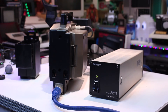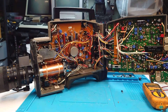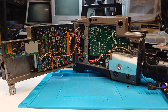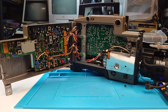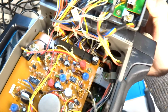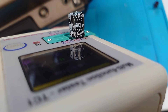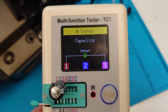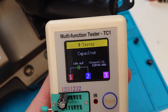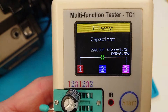Unfortunately I don't have a service manual for this camera — the only one I found is on eBay in America and it's about $20 just for the postage. I've opened the camera up and had a look inside, and I cannot see any internal fuses, which is quite unusual. I did spot a capacitor that was bulging, so I tested it in my capacitor tester and the reading was not quite right. I swapped that out, but it made no difference. I tested a couple of other capacitors and they seemed to be giving close enough readings, so I re-inserted them.